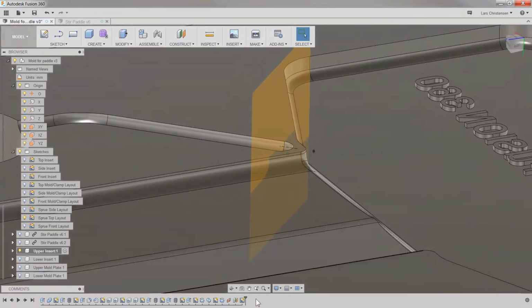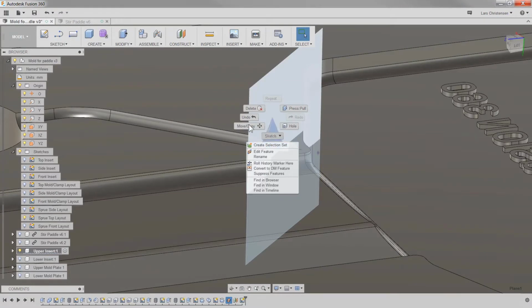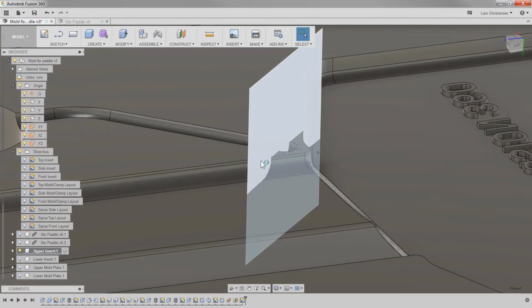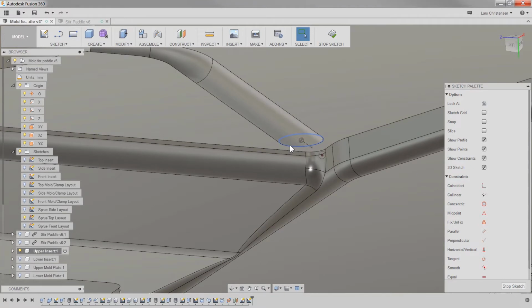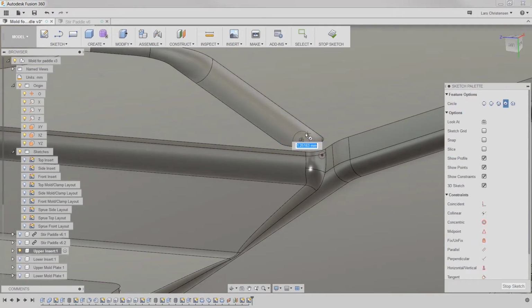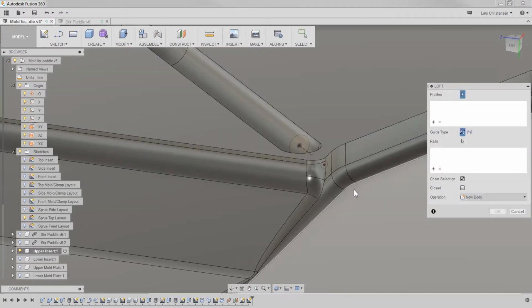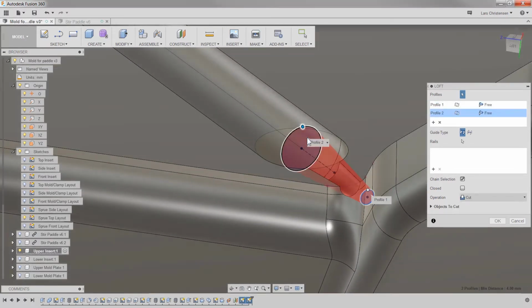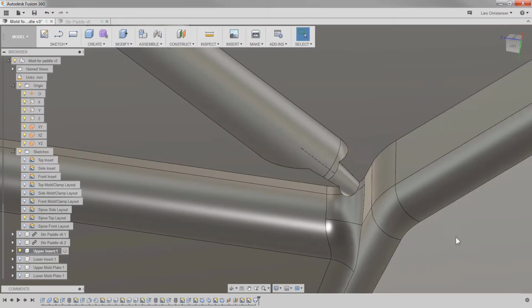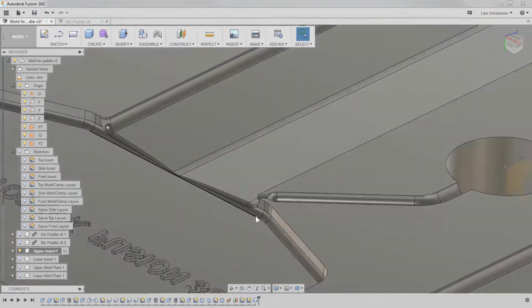And then if I go back to our original sketch over here, create a sketch on that. And I'm going to make that one a little bit bigger. Let's make it 1.5. And now if I create a loft cut between this diameter and this diameter, we get the cut, hit OK, and turn off the top layout here, and that would be the channel that the plastic's going to enter the part.